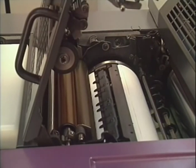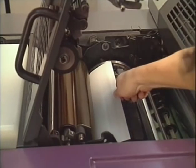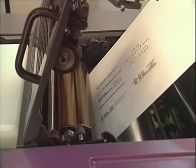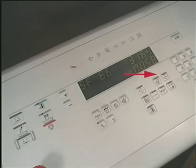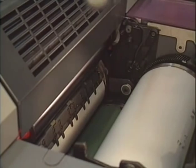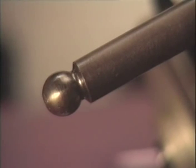Move the cylinder to the correct position to reach the rear plate edge. The rear plate clamping bar can be opened against the spring pressure with the operator tool. Hold on to the plate and move the cylinder backward to the front plate edge. If the small LED of the auto plate button flashes fast, the front clamping bar will open when pushing the button again and the plate can be removed. If you need to remove the plate from printing unit 2 manually, you have to remove the roller package first. Please make sure that the ball end of the rollers faces the drive side.